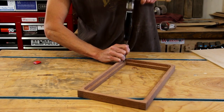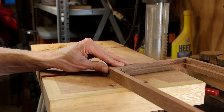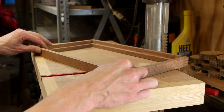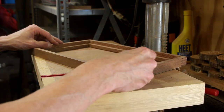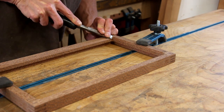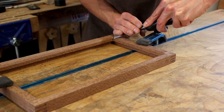After a few minutes squaring up the corners with a chisel, I'm going to flip the piece over and rout a chamfer along the top edge. This is purely decorative. Since that chamfer bit uses a bearing I don't get a square corner with this either, but that's easy to fix with a chisel.